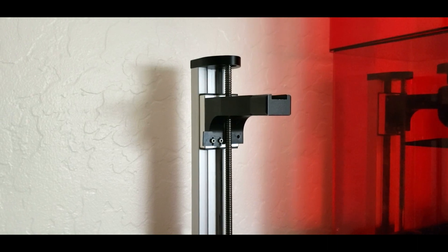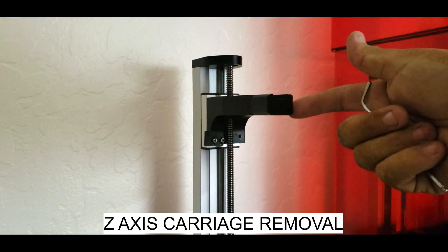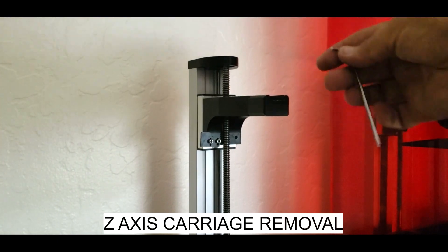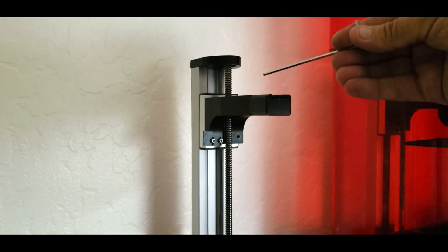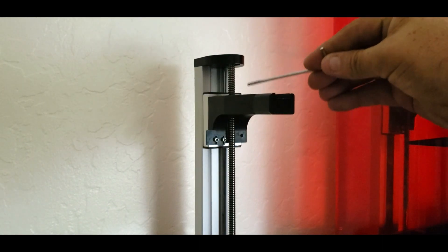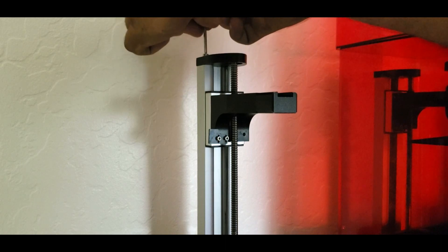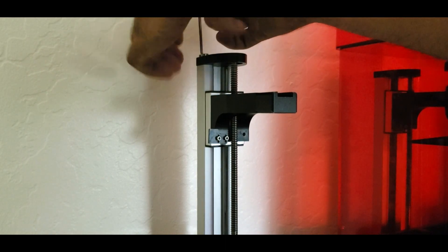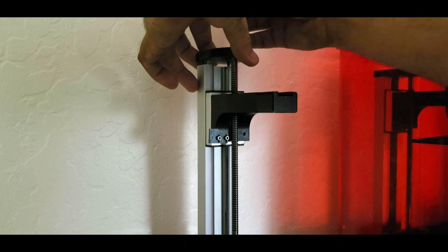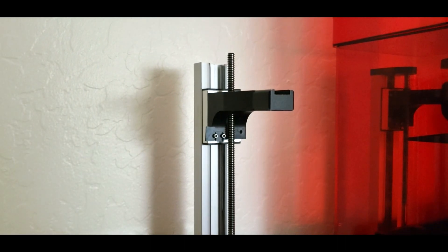The first thing we're going to do to get this z-axis carriage or arm assembly off is to adjust the bearing so this arm will actually glide super smoothly. The printer I'm working with is a gen one — it has the backlash nut on top. We'll remove this top plate first because we're going to be pulling this carriage all the way off. On the gen ones there are four screws — comes right off.